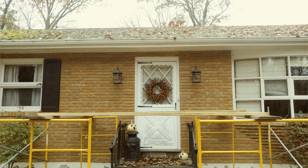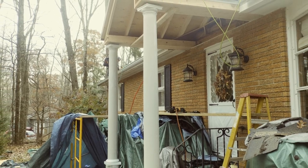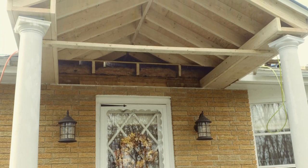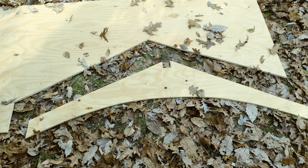This is what it looked like before. I used the backhoe to dig these footers and put in the sonotube forms, poured concrete about two feet high, then got these home store type fiberglass columns and built a framework. I took off the gutters and fascia and stuff that was in the way, and now it's time to cut these parts.